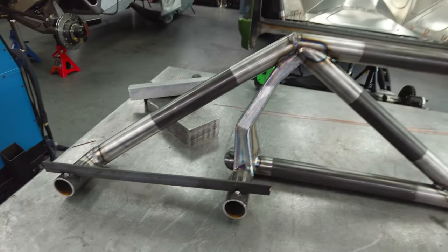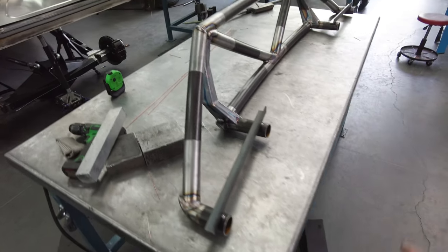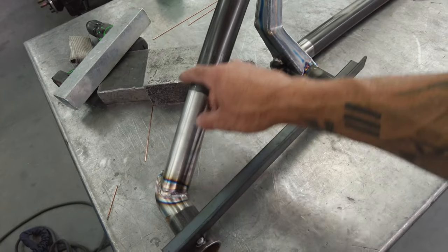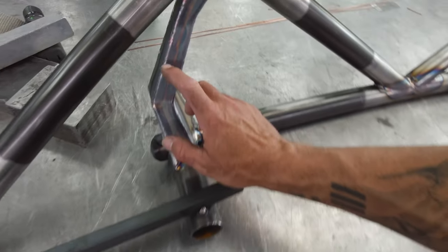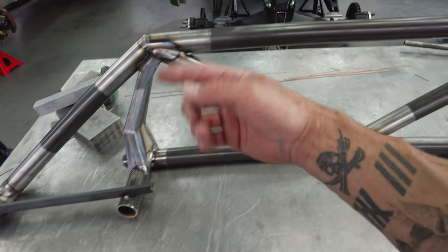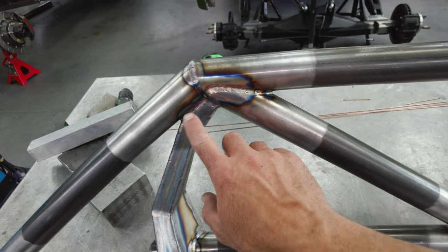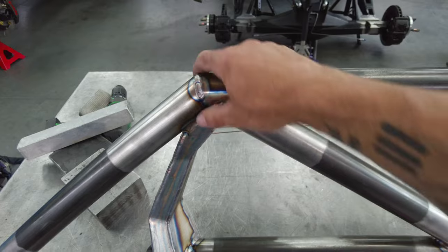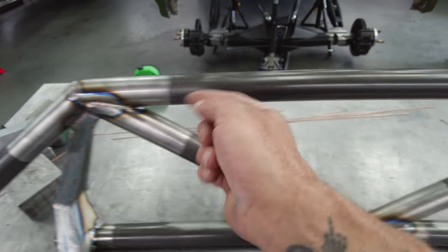But what we have here is our bumper, all compound rolled. This is for Vivian, our F100. Everything is chromoly, 1¾-inch, .120 wall tube, with .125 or 1/8-inch chromoly plate. Everything is completely welded. The tubes are welded before the plate work goes in, and the miter under the plate work and the tube is welded before that. So everything has complete 360 welding on it.